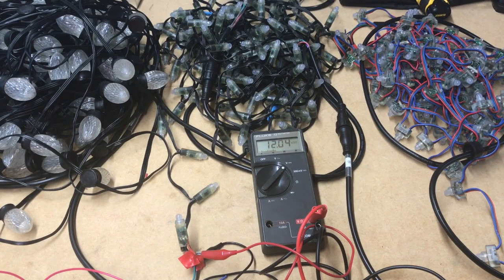Let your lights be your guide. If they don't look right, check the power — check the voltage. At the end of the string, if it's more than a volt or two, that's probably an indication that you need to inject power. You can inject from either side or in the middle of the string — it really doesn't matter. Data is the only thing that is serial and goes one way, but power can be injected really anywhere. Whatever is most convenient for your display is pretty much where you put the power. I hope this information was helpful. Thanks for watching and I'll see you again soon!